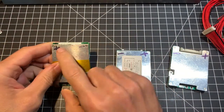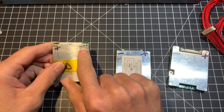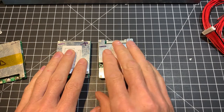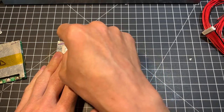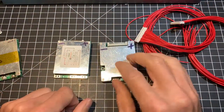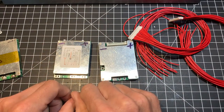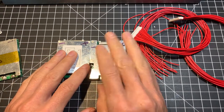If you need to replace your old BMS, your old BMS has a reverse balance connector, meaning it starts with the positive and goes down to negative. All the newer models you can find online have a standard connector, meaning it starts with negative and goes up to positive. It's the same connector, same size, it fits, it's compatible — but the polarity is off. So obviously, if you just replace it, it will probably do a little zap or smoke or whatever, and you will need to find a new one again.